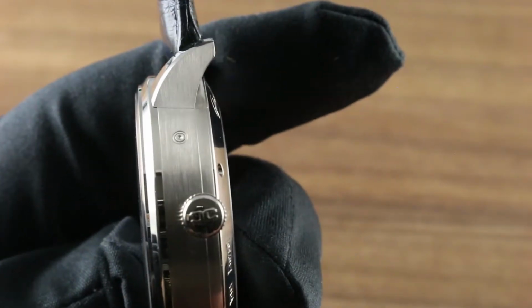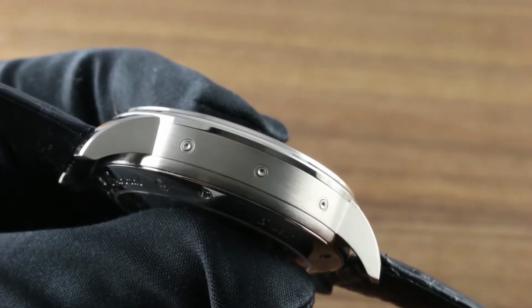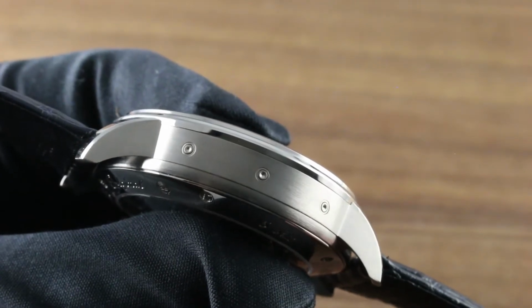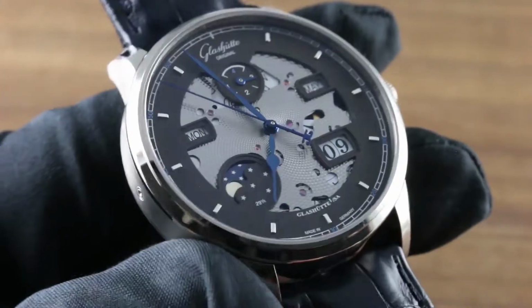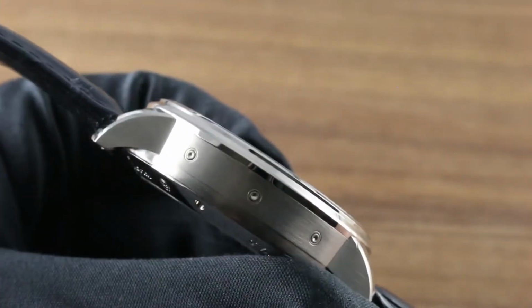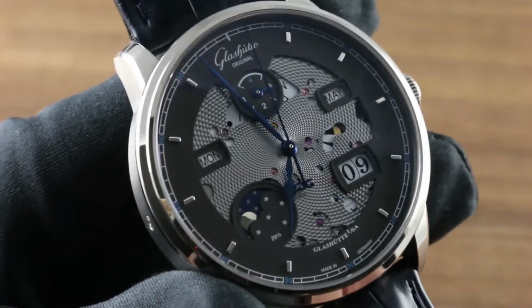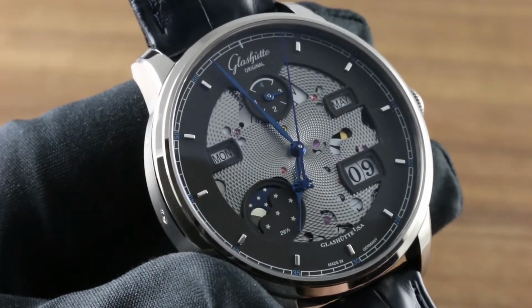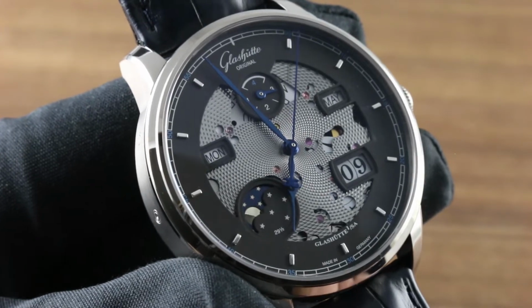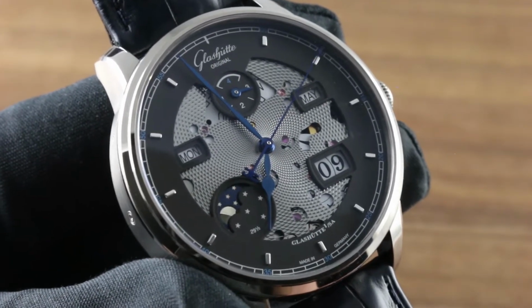The perpetual calendar is set using the 4 dimple adjusters on the opposite case flanks of the watch. It's important that you use exclusively the Glashütte Original pusher adjuster tool included with the watch to avoid physical damage to the case that may undermine the integrity of both the movement and the watch's watertight hermeticity. With respect to water, it's important to note that H2O represents one of the 3 primary hazards that your watch will face: water, magnetism, and shock.